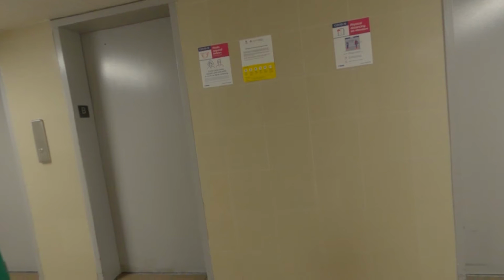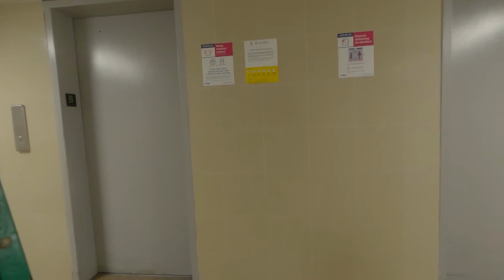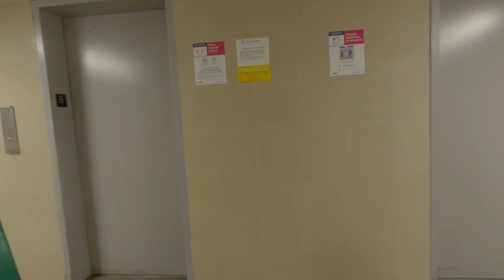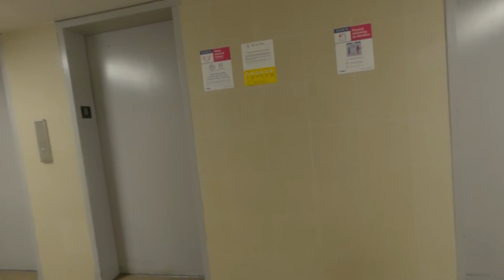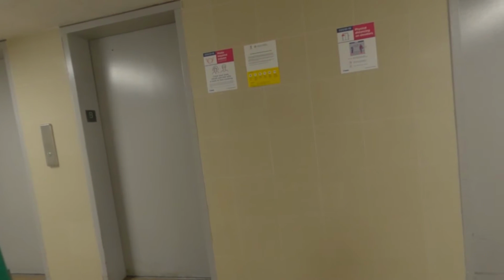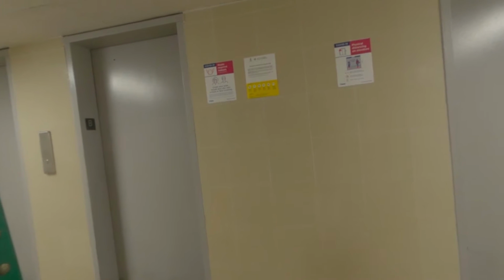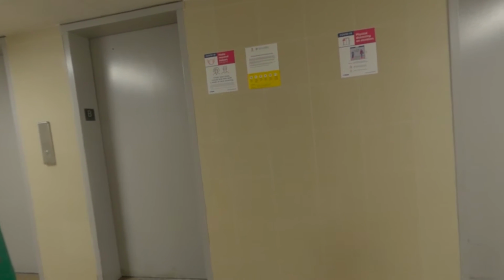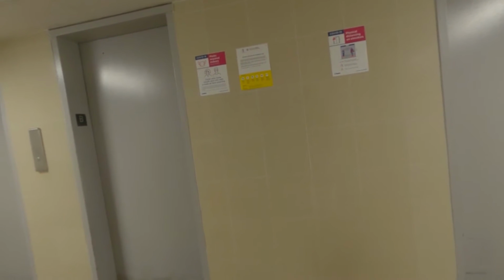Elevators. So we're probably gonna have a lot of AC drains in the next couple months here. It's the middle of summer, and you find that the AC drains always back up in the middle of summer, obviously because the machines are running, but over the fall and winter, everything just kind of congeals together. And then once they start kicking the ACs on, everything starts flooding out.